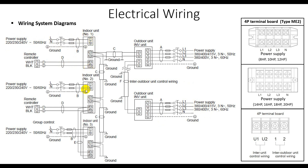Another topic is about the signal wire. From outdoor unit to outdoor unit, it connects to terminals 1 and 2. From indoor unit to indoor unit, it is U1 and U2, connecting to another indoor unit's U1 and U2. The connection from all indoor units to the master also uses U1 and U2.